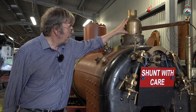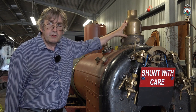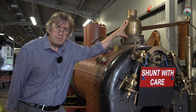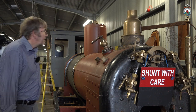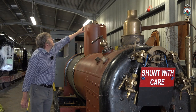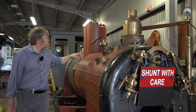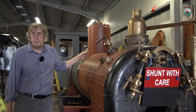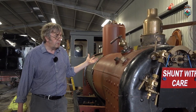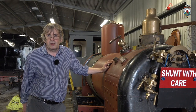The Salter safety valve is to an original pattern set on top. Originally the loco had only one safety valve. As an extra safety feature we've added a modern safety valve on top of the dome which will be hidden from normal view. But it provides two safety valves on the boiler, which is considered much better practice than just relying on the one.